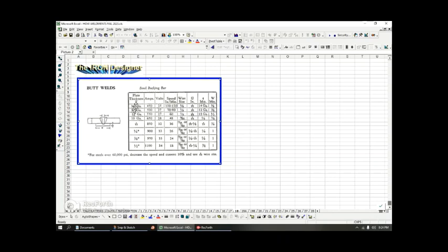And so when you look at the steel backer bar, you could probably go with a thinner backer bar, like a 16 gauge backer bar, and you're getting down into the ranges that we were talking about before. If you have just a thin backer bar and you're bringing your amps down to, our rule of thumb was 300 amps, maybe 27, 28 volts, and we're lowering down the velocity of the weld. Here, I can't believe the speed, 100 to 120 inches per minute with a 1/8 of an inch weld wire. So this is what automation can do, but we need to take automation values and convert them into hand welding concepts and hand welding values.